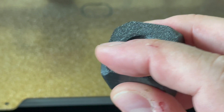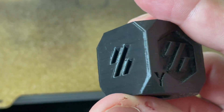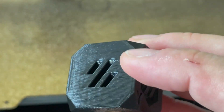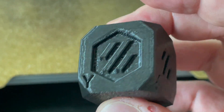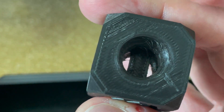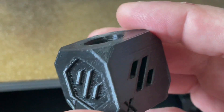I'm not crazy about the texture on the bed - I may need to get a better smoother texture. That's supposed to fit a bearing and I'll have to measure those with calipers. I can see I need to fix the pressure advance to get these cleaner cubes, and then I'll work on getting rid of those resonances that are causing that ghosting effect. There it is - a little bit of stringing. Not bad for the first print.